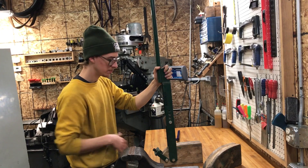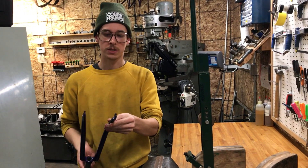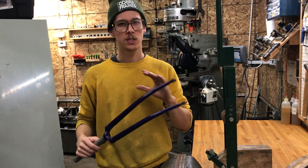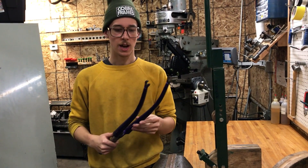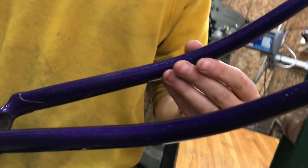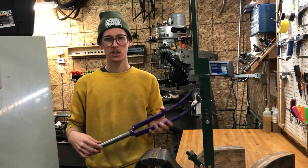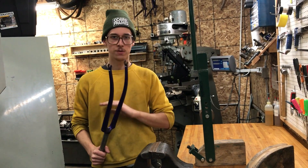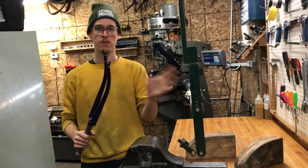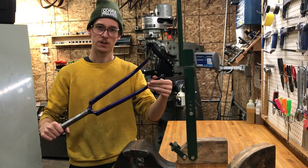There's a clamp mechanism — it's really very simple. The idea is that when you have a tube like this, it's relatively heavy wall to its diameter, so when you go to bend it, it's going to ripple just a tiny bit on the inside and stretch a little on the outside — very, very subtle. When you go to do that with seat stays, chain stays, and main tubes of a bike with traditional wall thicknesses, it's just so thin it wants to ripple and kink. You need a much more sophisticated bender that fully encapsulates the tube and holds it tight at the point of tangency. But these fork blade tubes are easy to bend as long as you bend against something, have enough leverage, and it's held securely.